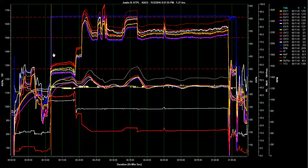We come up here to takeoff power. A couple things I see: one, RPM is low. Two, your TITs are a little bit on the high side. You're expecting to see about 1275 on the ratio that's there. You can tell that the CHTs here climb throughout your short climb.